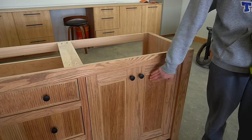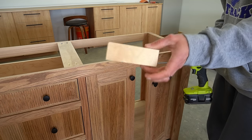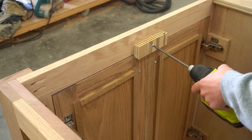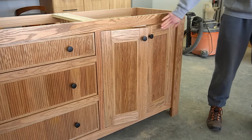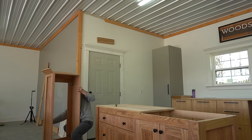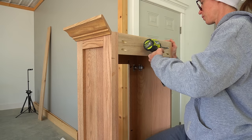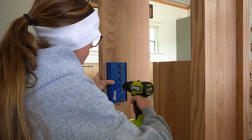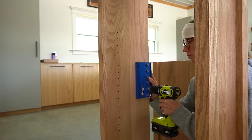One thing I really hate about inset doors is they always swing too far in, so I screwed a small piece of scrap plywood just inside the frame as a stop block to keep them flat to the frame. I also realized I'd forgotten to add a support block at the top of the cabinet to be able to secure it to the wall, so I cut and attached one. Then I remembered I'd also forgotten the shelves for the top cabinet, so I drilled shelf pin holes, cut a couple of shelves, and put the door back on.